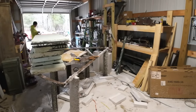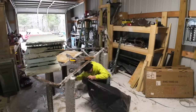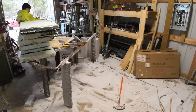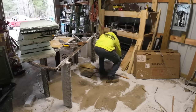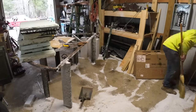I do think it's worth pointing out that you saw that. I put that AC load into it off of the use while welding outlet. The machine said, hey, I don't like this. It sent off the alarm and it isolated that circuit. That's what it's supposed to do. That's what it's designed to do. If it's got too much coming in, it's gonna shut it off. If it's got not enough coming in, apparently, that's a thing too, it's gonna shut it off.